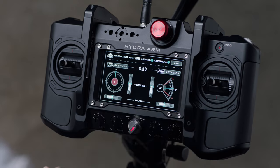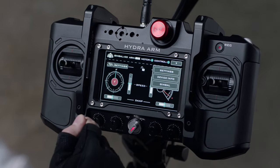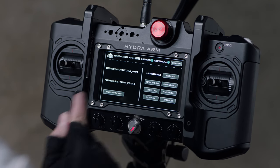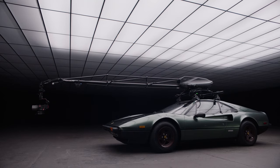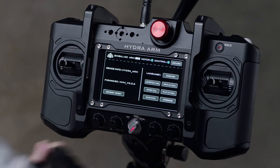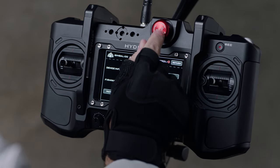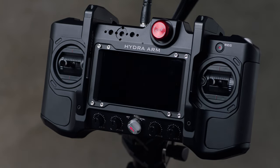To open the main menu, first unlock the screen by double tapping the lock icon. To calibrate the new horizon position, press device info, then press gyro — you will then hear a beep. To save this setting, restart the system by turning off control, pressing the red button to disengage the motor, and then turning the dial all the way to the left to power off the system.